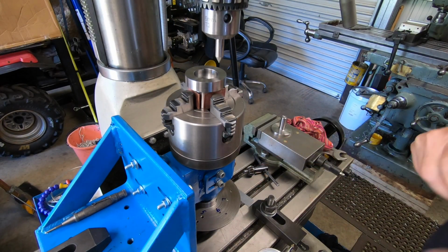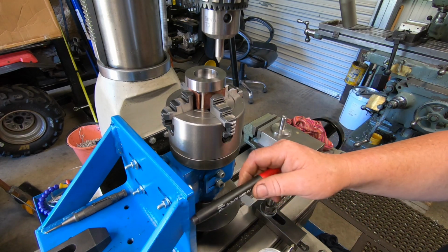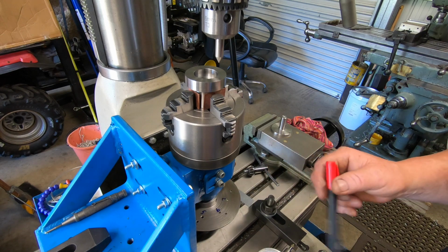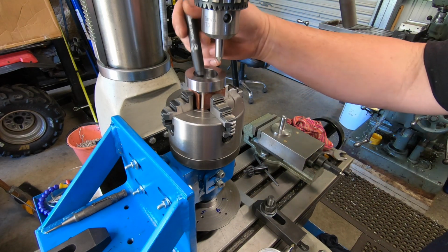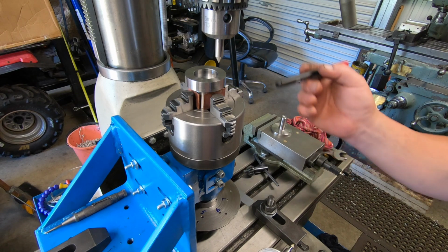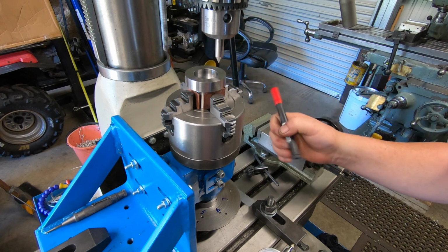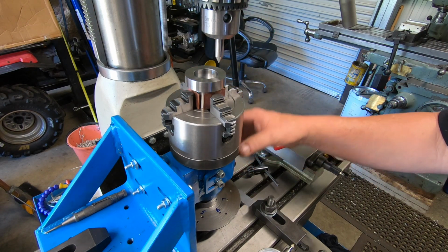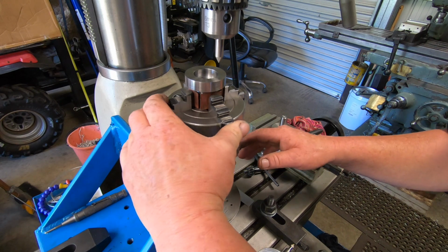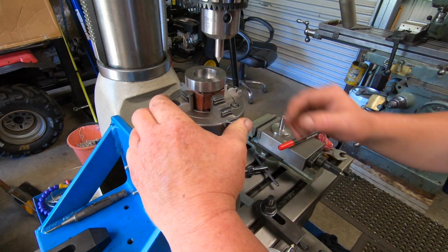We're here at the mill drill. I've got the indexing fixture set up on the homemade angle block, which is reasonably close. Wouldn't say it's 100%, but it's close. I found centre and then set up an indicator down here, and moved across to put the 4 holes in. I can lock the spindle on this, and I've got a plate here I made up with 8 holes on it, so I just go every second hole and index around to get the 4 holes put in there.